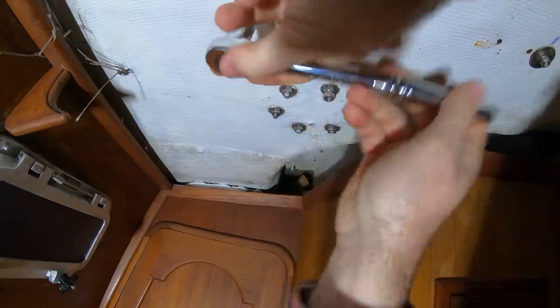The bottom of our traveler is all cleaned up now. We've drilled countersink holes going through the deck and filled those with Butyl. We also have Butyl backing on the traveler and little collars around the top of the bolts. Now it's time to lay it down and tighten up the bolts and nuts. Pretty simple.